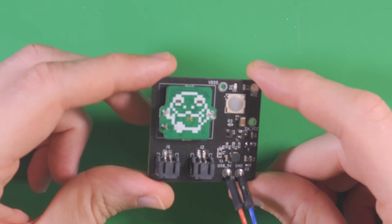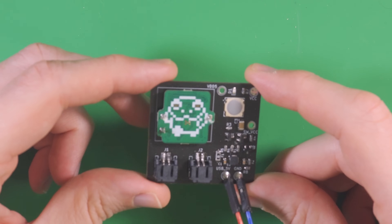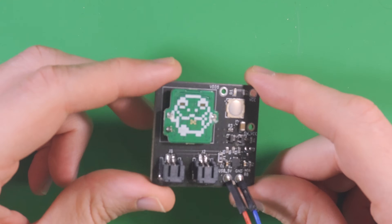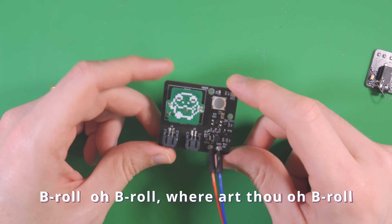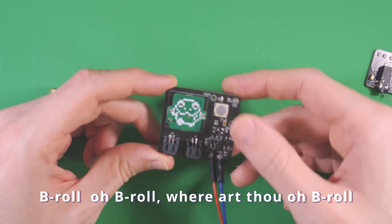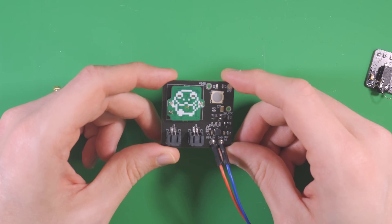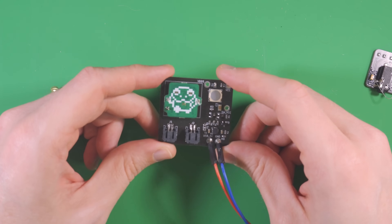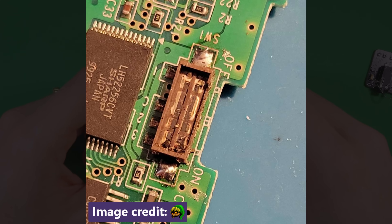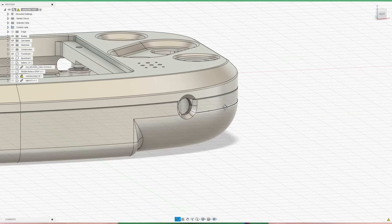The other circuitry comprises two new pieces. One is a battery charger built around a TI BQ2407 series chip, which also handles power path management for charge and play support. The other is a soft latching power switch, in contrast to the GBC's slide switch. The benefits of this are two-fold: because the full system current no longer goes through the power switch, it's much less susceptible to carbon and dirt buildup on the switch contacts, a common failure point on the GBC 25 years after it was released. Additionally, it greatly simplifies the shell design by virtue of using a simple push button.